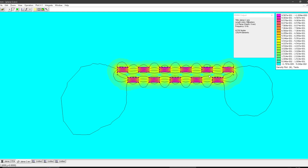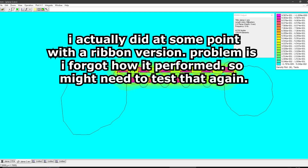I think the Diptyque design is not very efficient. I don't know how linear it is — they call it push-pull, and what's interesting is the number of field reversals means more spots to put traces. It will probably not make up for the loss, but it might come close, and you'd have a more evenly driven membrane. Then again, there's always a magnet behind the traces, which could show up in the frequency response — hard to say without building one.